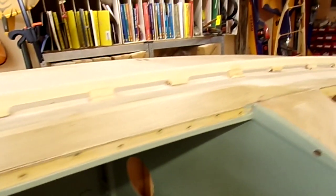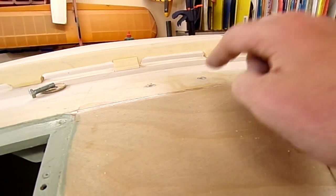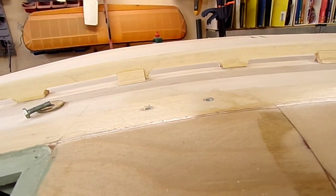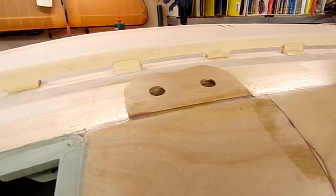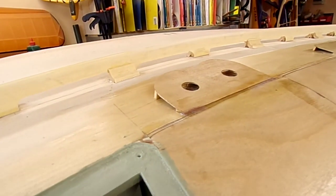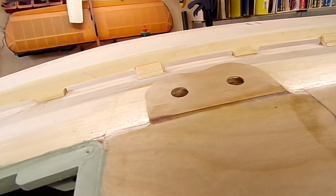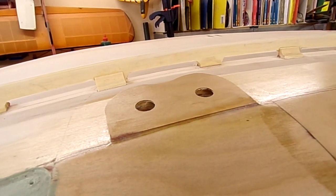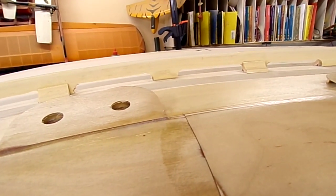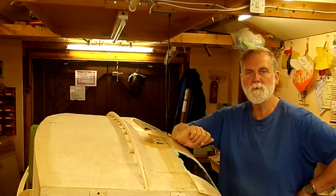There's the section glued in place. I've given it a quick coat of varnish. My next bit is to prepare some washers to bond on here and then create the cover plate to go over the top of those. There's the plate in position, bonded in — similar principle to the one back there, just extending out a little bit further. I've drilled 19mm or three-quarter inch holes for the grommets, which allows a socket to drop nicely onto the bolt heads sitting inside. That's all been varnished up and I'm going to have a second coat.